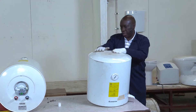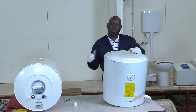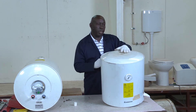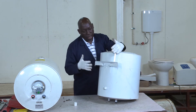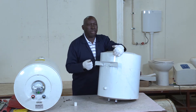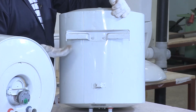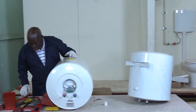From this point, following the introduction, we are now going to the practical mounting or installation of the cylinder. I would prefer to install the big one so that it's clear, but I'll turn this and show you. Because of its importance and sometimes vulnerability, we don't fix it permanently. When fixing a hot water cylinder, it has these support brackets, and what you build into the wall are hooks that hook onto the bracket — I have a set here to show you.